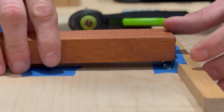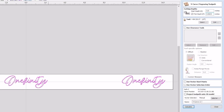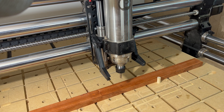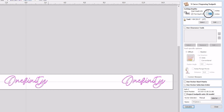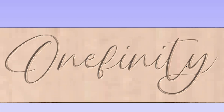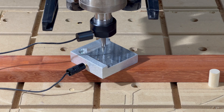To do that, I'm going to send this board through the planer, just slightly shimmed up on one side. That'll mimic what would happen on an uneven wasteboard. I'll create a vector with a nice little fancy script where the stroke transitions between thick and thin — that'll do just fine. I'm using a 90-degree V-bit to run this test, and I'm going to zero out my X and Y axes and probe for Z at the center of the board, because that's right in the middle between the thickest and thinnest part. I set the cutting depth to a maximum of 1/16th of an inch, and I chose this typeface because there's a good amount of variation in the width of the strokes — it gets really thin in some areas and wider in others. The wider parts are where the bit should be cutting deeper into the material. The program is loaded, everything's zeroed out — let's run it.